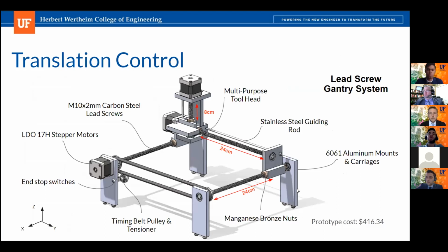I wanted to mention the reason that we're doing one motor that's going to control both the guides of the x-axis. One of the concerns we had was originally we had 2 motors and we were going to try to control them simultaneously. And when we realized how difficult this was going to be, we still couldn't have a guiding rod that would enact on the separate x-axis rail, as there would be a binding that would occur. So instead, we came up with a solution of using a timing belt, which is not going to lose its track, with a pulley system, and it's going to be fully tensioned, so it's never going to lose its position. And then everything else just uses the guiding rods made of stainless steel. That way it all stays balanced and it stays pretty accurate and maintains its rigidity.